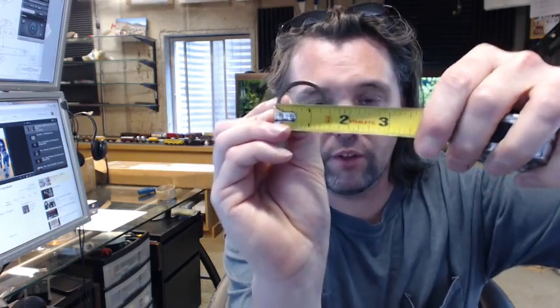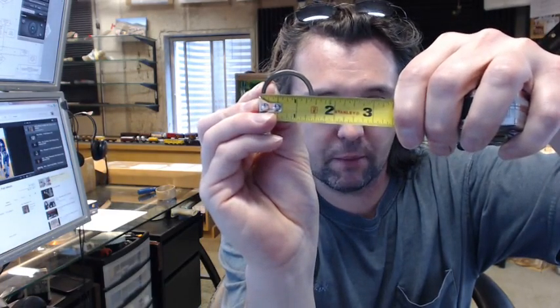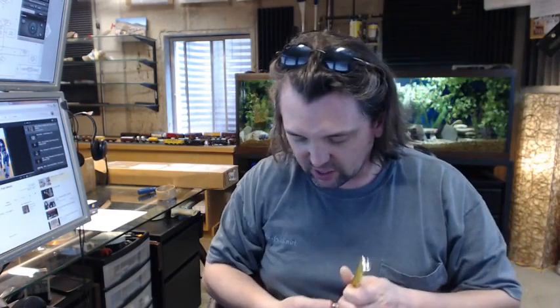The overall diameter of this ring and all of their other 861 series rings is 1-7/16ths, and the inside dimension is approximately 1-1/8 inch, which is typical for mortise or rim cylinders. Again, a straight collar — very common, different thicknesses available and different finishes as well. If you have any questions on the Kaba Ilco 861K-46-10 aluminum DuraColor Brown cylinder collar or blocking ring, or any other Kaba Ilco product, please feel free to reach out to us. Thank you.